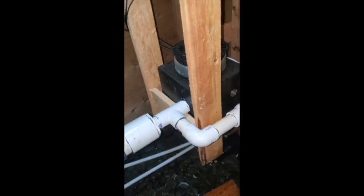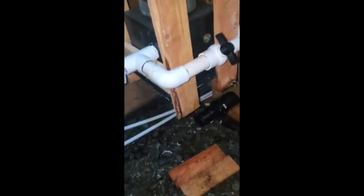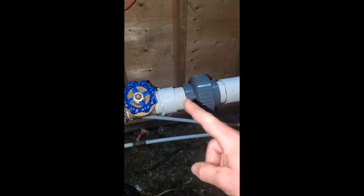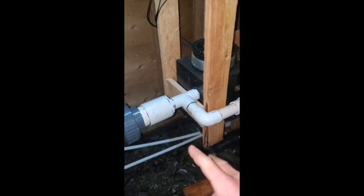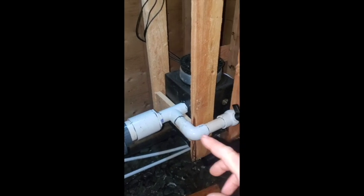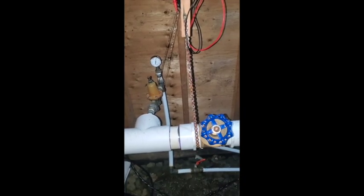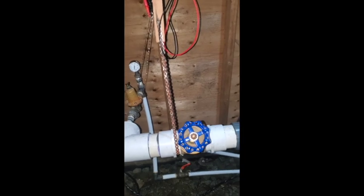What we've basically done is put the nozzles back on but disconnected the drain. So we can open it all the way up with two nozzles on, wait for it to get plugged, turn it off, take the nozzles off, clean them up, and just do that over and over again until hopefully all this plastic has been flushed out.